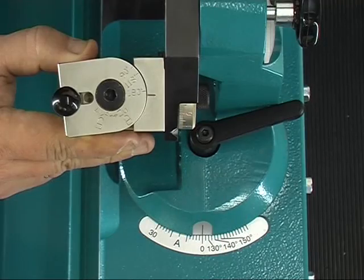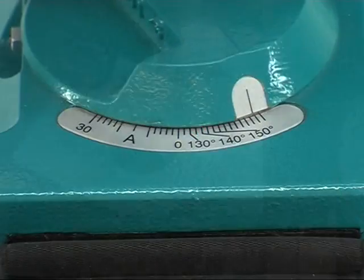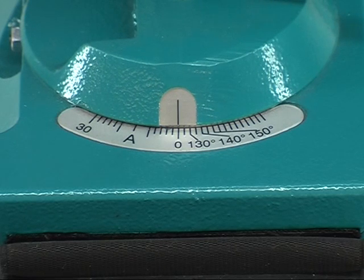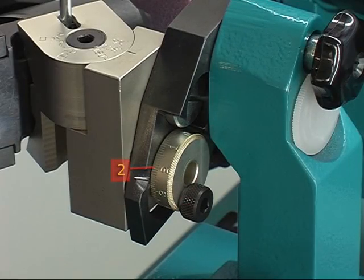The point angle comes to 90 degrees. By opening the clamp lever, it can be set continuously. If angles differ, it is recommended to align the cutting edge directly alongside the grinding wheel. The clearing angle scale has to be set on 2.0.